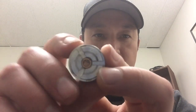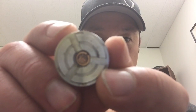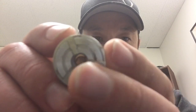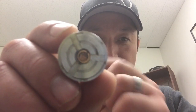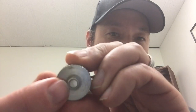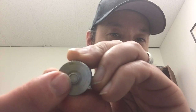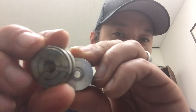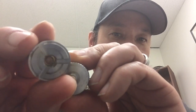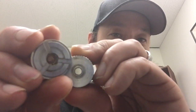The other problem with mech mods we see is, see how wide that pin is in there? If this pin inside were to shift even 0.5 millimeter, you will now bridge this and this together. The outside is the negative and the inside is the positive. That is not much tolerance. There's virtually no room for error with things like this.